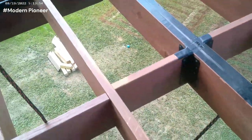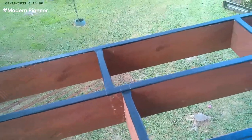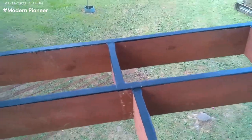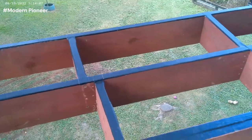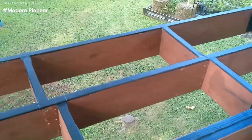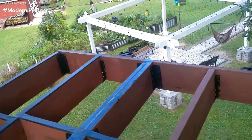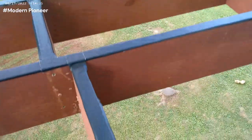So the G tape is specifically made for decking or joists. And what I found in comparing them to Gorilla tape, which I just thought G tape was short for Gorilla tape, but no, it's a separate thing. This G tape has a little membrane on the inside underneath of it. So if you put a screw for your deck in it when I lay the decking, the membrane will help seal behind that screw. So that is one up on this Gorilla tape, making it a little bit more durable. And you can see a little bit of that membrane sticking out there.